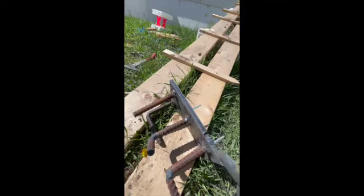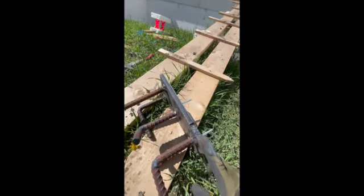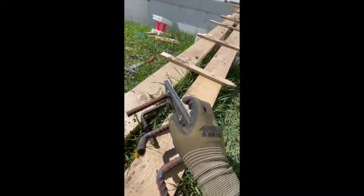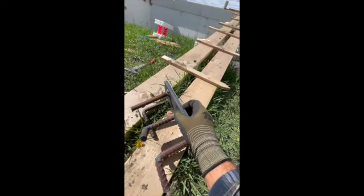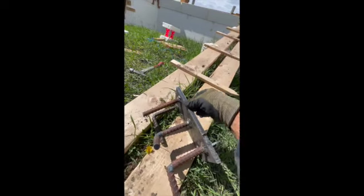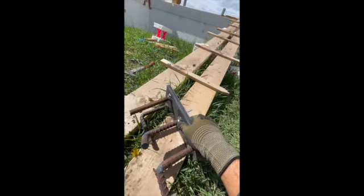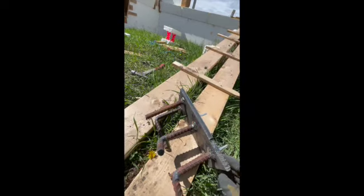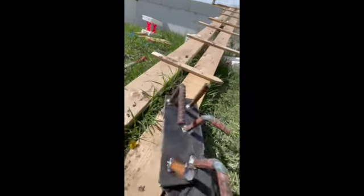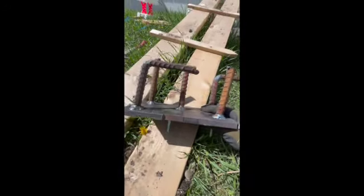So the study, I'll link the study in the video, had 3/8 steel plate, and I can't remember how thick their rods were, but I have 5/8 rod, which is plenty thick. I think their rods were actually thicker than their plate. I've welded them with MIG on the hottest setting so I could get good penetration.